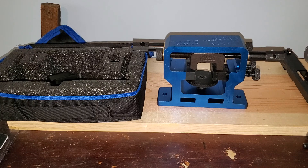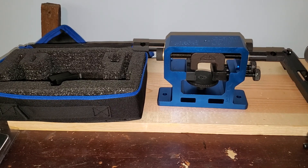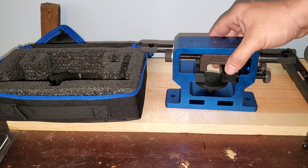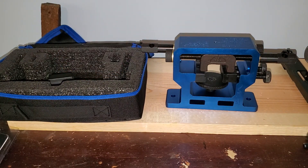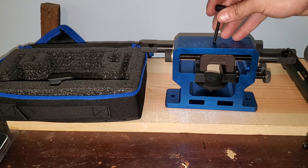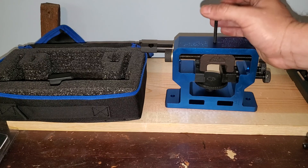I actually had to file some of the front sight off, and even then it was pretty tough to put back. So I did the front sight with a hammer and a brass punch - I've done videos of that before and you can watch those. But anyway, if your sights are not exceptionally tight this is handy, but when they're really tight you're going to need a hammer.